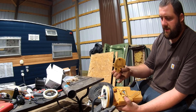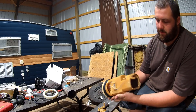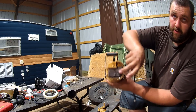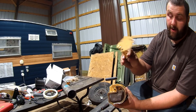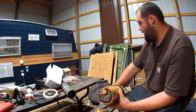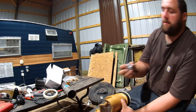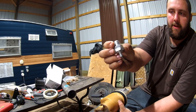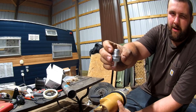Basically the sending unit has a pocket here where the fuel pump sits. The sock is in here — you take this off, and that grants you access to there. That little piece I showed you earlier, I can't remember who I got this from, but it's a bulkhead — 3/8 barbed to dash 10.